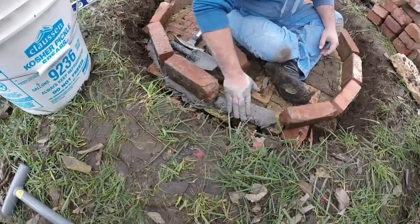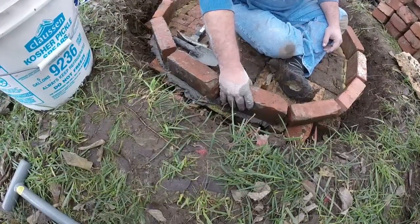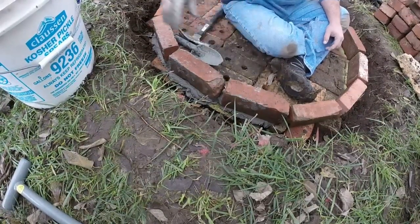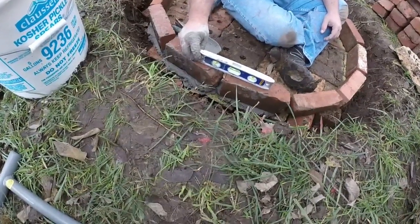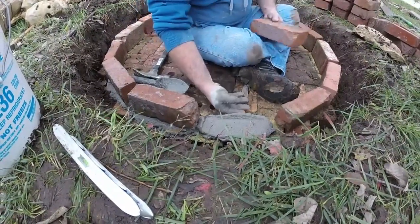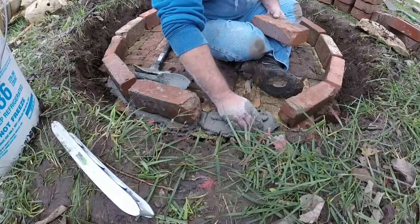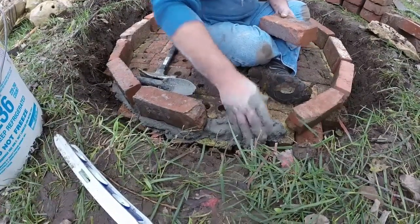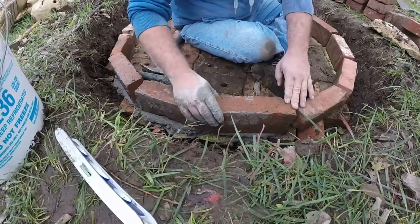That's the Quikrete mortar we used. That's actually where the $15 came in handy. It was $5 a bag. So mix that up to an appropriate consistency, where it will hold its shape. Set the bricks equally spaced, and you're going to use that painted line as your guide. And then you can use a small level to make sure that you get it level, and then you can take away the mortar or add to as needed to ensure that your side walls are level.